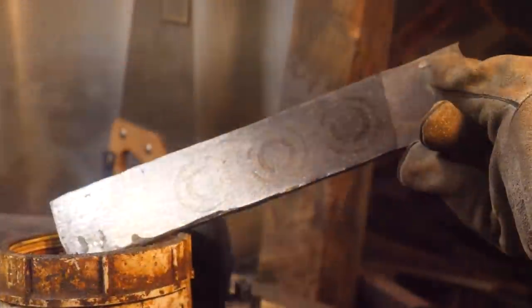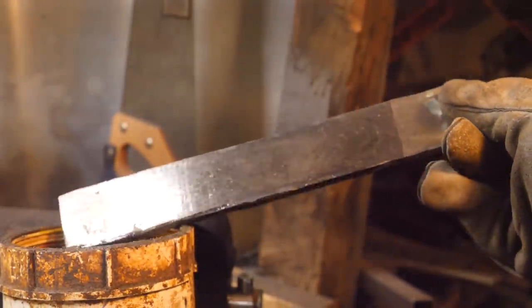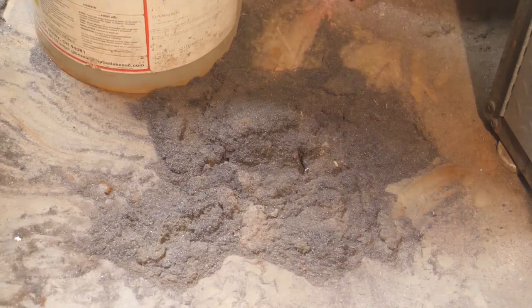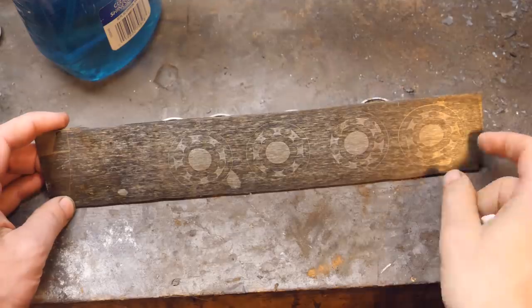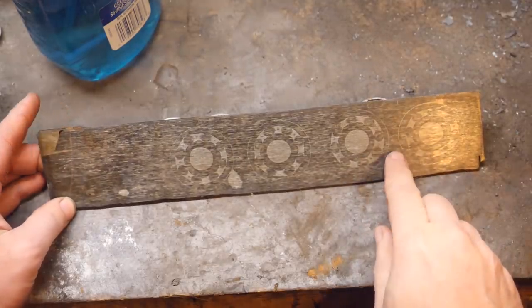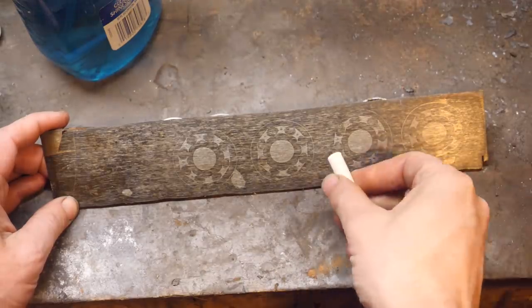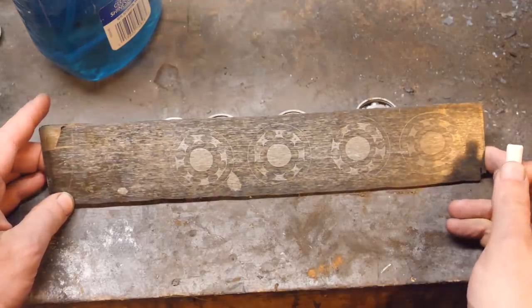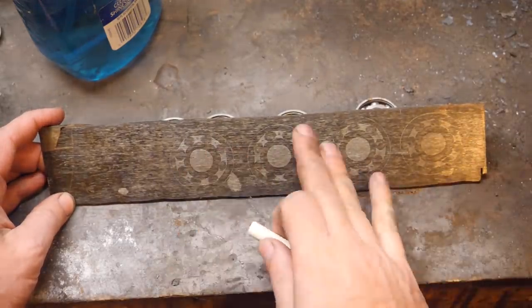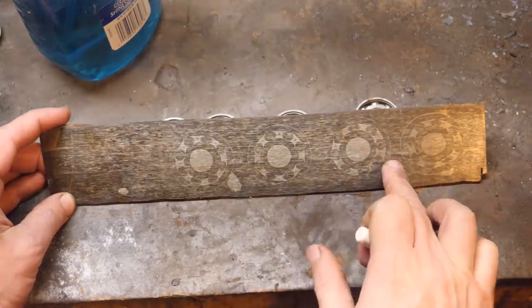That pattern looks pretty good, but we're going to have to grind down a little deeper to get more detail out of it. How much deeper? A lot deeper. I'm noticing a couple things. First is that when I cut these holes, for whatever reason, somehow this distance was not quite right. It was closer than these two, which is sort of a bummer because I measured that sort of closely. But as things have spread out and the billet's gotten wider and longer, this discrepancy becomes more noticeable.